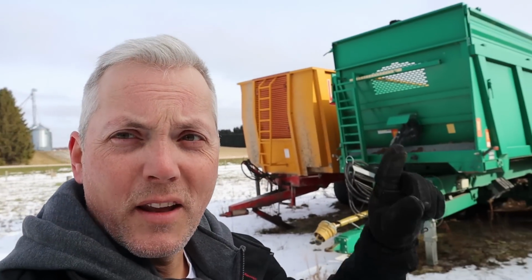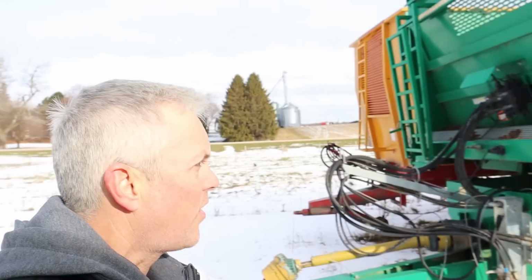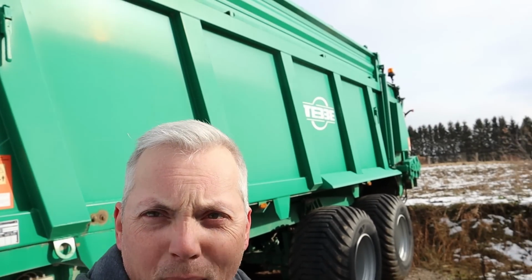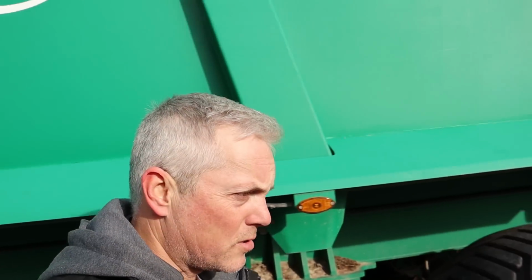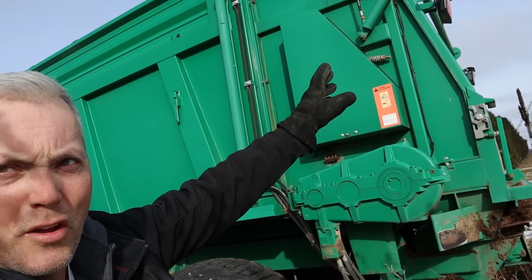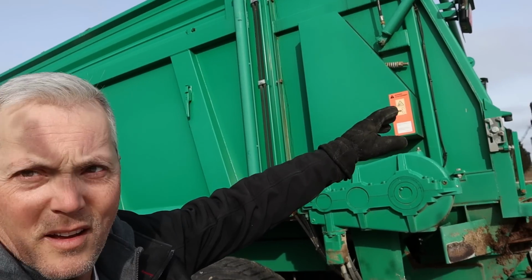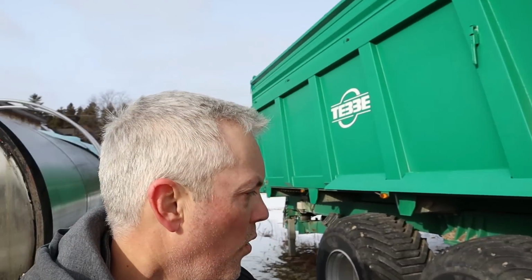And this always makes me sad because they have to sit outside because I have nowhere to put them in sheds, but that's the manure spreader. It's a Tebbe. I don't know what model it is. We use it to spread about 2,000 tons of manure a year. And it's been a really good spreader. If you look at the back, it's got a canopy, so there's 2 horizontal beaters in there that break up the manure, and then it drops down on the spinners there, and they fling it out. If you're curious to see how it works, there's a video I have in my channel somewhere that shows it in action.